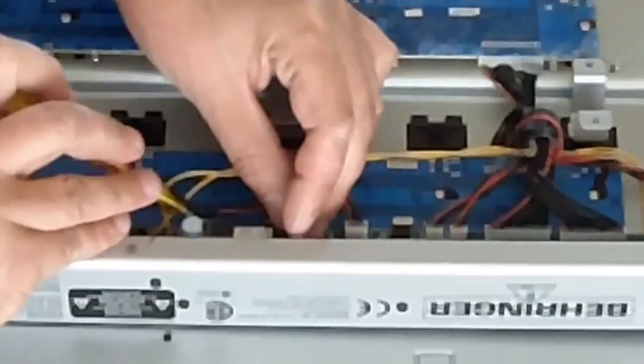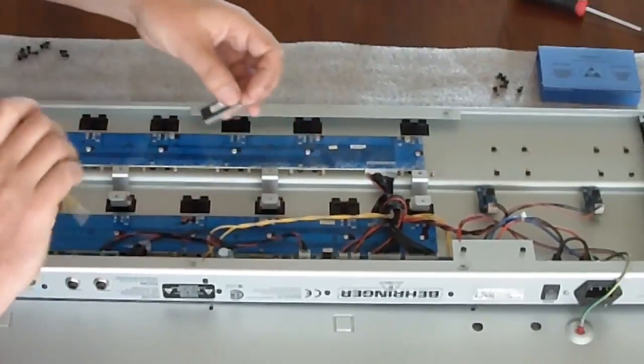I am just getting rid of the hot glue now. That is really the hardest part of the whole upgrade, because we need to be careful not to damage anything in the neighborhood of that EEPROM. Try to lift it out of the socket — both sides at the same time. And there it is.